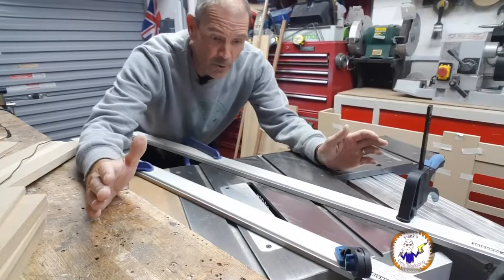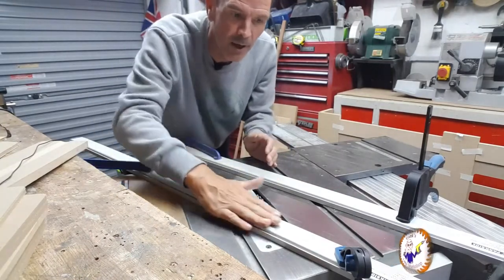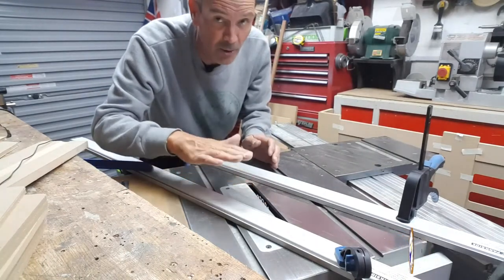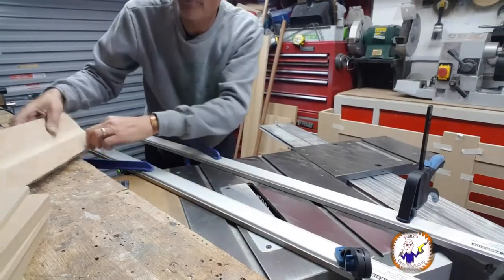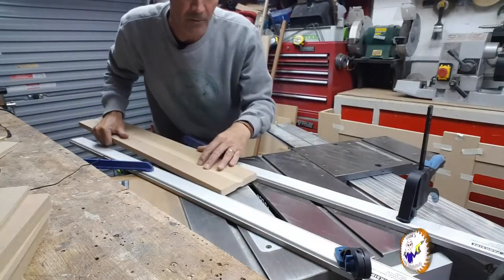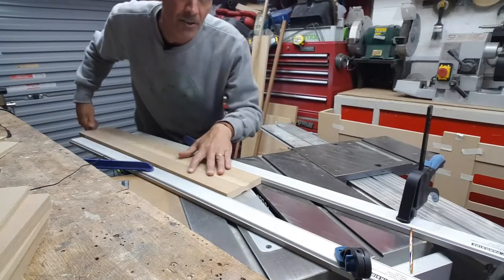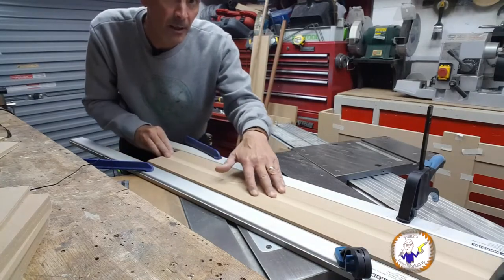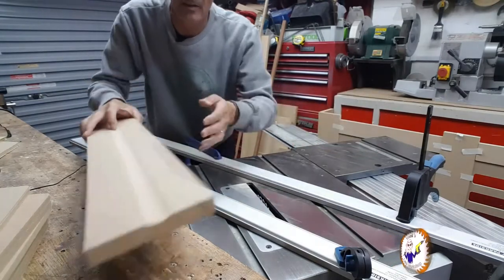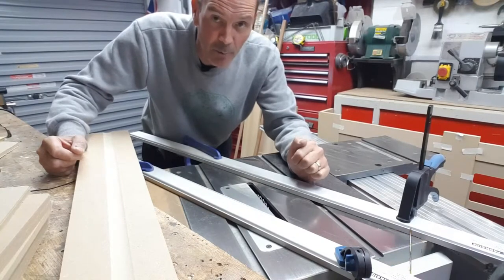Okay, so what I've done on my table saw here, this is the normal direction of cut. This way, here's the blade. What I've done is I've put a guide rail, or two guide rails, diagonally across the blade. Not touching the blade, obviously. And the idea is, my piece of wood, or MDF, that I want to cut the groove in, I basically run it along the guides, diagonally. And then that will give me this groove. That's the plan. And now this makes a lot of mess. So let me get this set up properly and I'll try and do them.